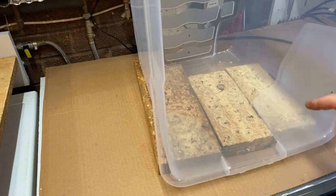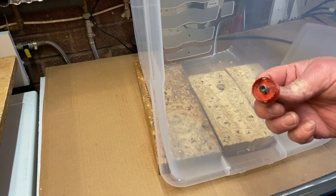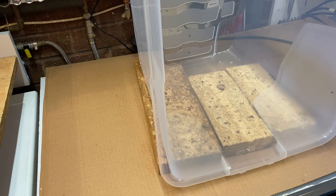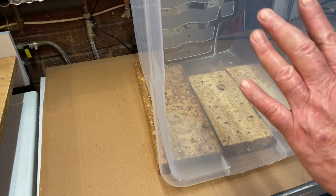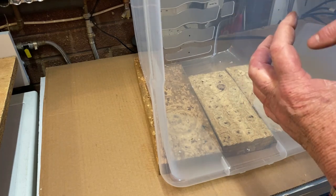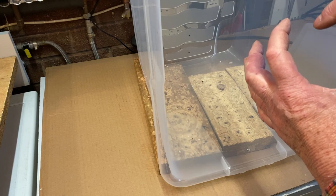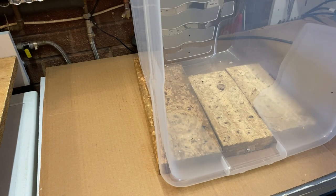Right, so these holes here are all going to be 25 millimeter using the hole saw. I don't do them now. I drill all the small holes first, all the pilot holes, and then I do all the bigger holes. If you find it does crack, let's say it's cracked to the middle of the plastic and there's a little crack going outwards, get a small drill and just drill at the end of the crack, and that'll stop it from going any further.